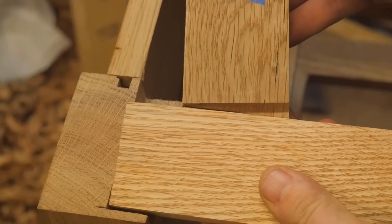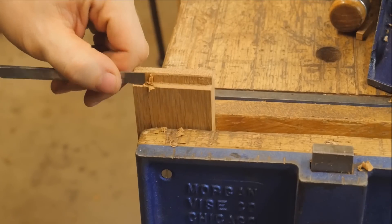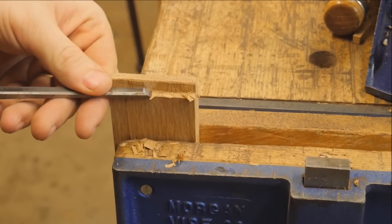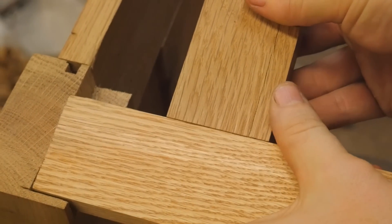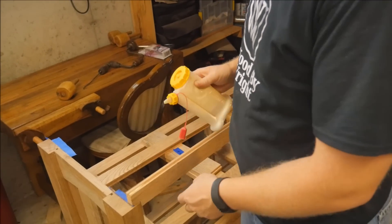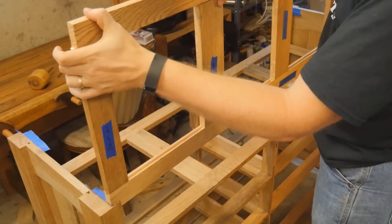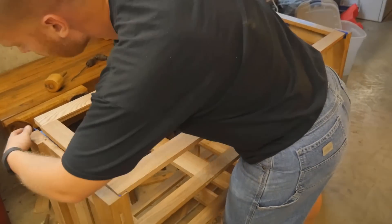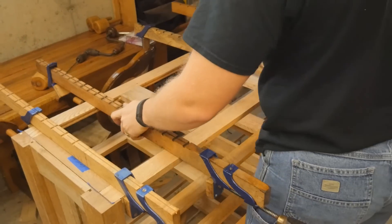Now I want to test them in the groove and make sure they fit. This one needed a little more work — it was working on one side but not the other. So I take it back over to the bench, pare out what I need to remove, and make it fit just like butter. After a little bit of wiggling and finessing, I fit them into the groove and get the perfect fit I'm looking for. Now it's time for glue-up. I put blue tape in the top of the legs so I can glue this up in place without it adhering to the surface, allowing me to square it up to exactly what the dresser is.